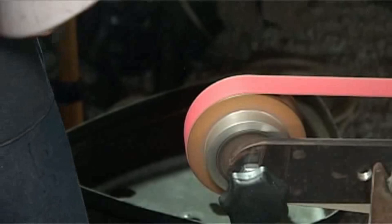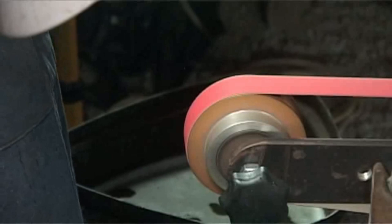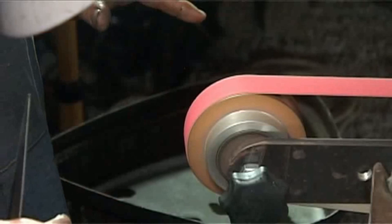But when you hear fighting cats, that kind of grating sound, that is when you are pushing your knife at the wrong angle and you're creating a facet, usually combined with an intensifying of the sparks, which get bigger and brighter. Stop. Before you grind any further, stop. Because you're just making nonsense.